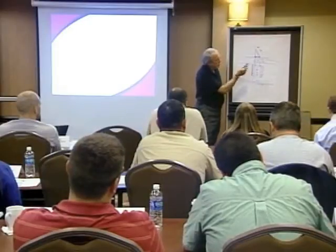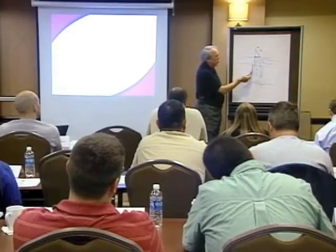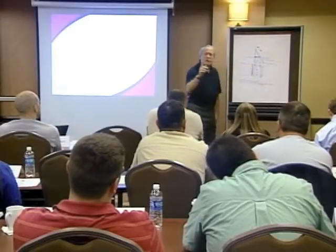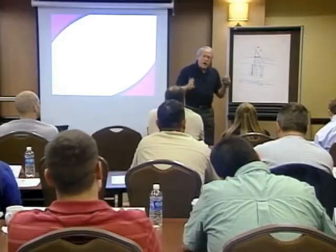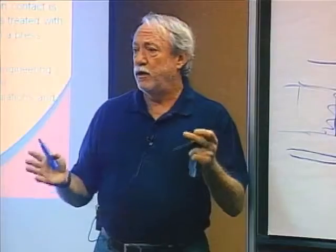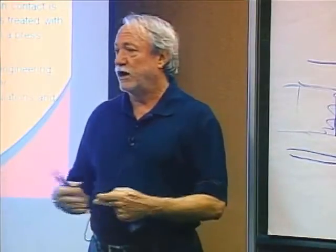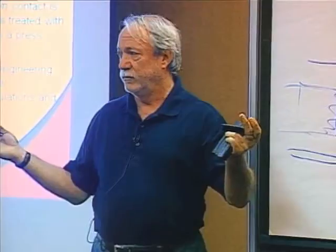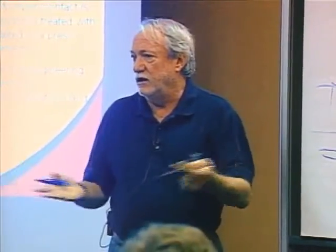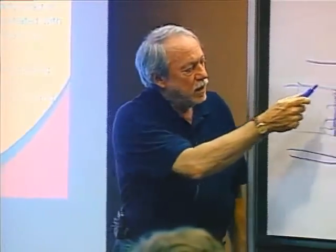There was something else I was going to say, it'll come back to me. But you're right, the adhesives on the rubber, the catalyst, I was going to say this. The common mistake made in splicing nylon core, and everybody knows, a belt is no better than the splice. If the splices don't hold, the belt's worthless. It can't run, it's no good for anybody. So splicing is critical to belting.